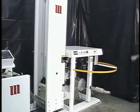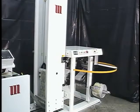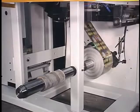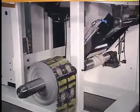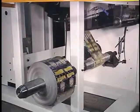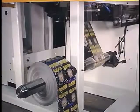Upon initiation, the winding roll is stopped and the festoon accumulates the web at full process speed. The cut-off blade in the transfer section severs the web, and the turret indexes, presenting the finished roll for removal. The transfer section lowers, attaching the web to the taped core, and the spindle accelerates to wind the roll. The STR is designed to begin new rolls without web foldback at the core, eliminating a source of wrinkling and material waste.